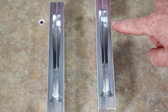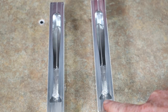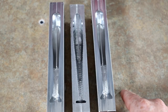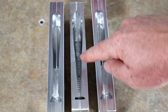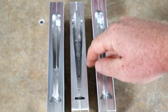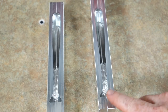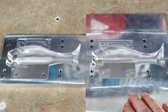Another design feature speaking to pourability was width from the top. We kept the tapering to a minimum — the tail opening is massive. It's a lot harder to pour a small tail, so we wanted to keep our tail open and not narrow it too much, so you can pour it from the top all the way back just as easily. Obviously molds this size are still relatively easy to pour even when they get skinny, but we wanted to focus on overall pourability and leave the top largely open, primarily in the tail section.